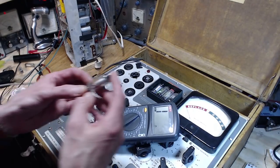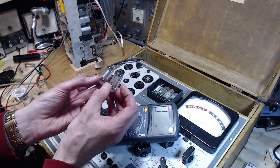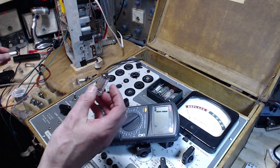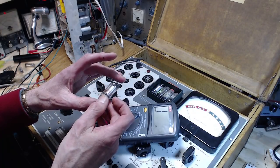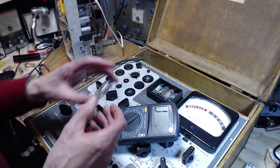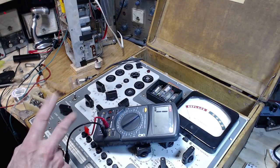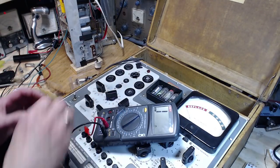Well, okay, picture's changed a bit, so I found another one. It has the correct shape. Except, you know what? It's not a 3V4. Unfortunately, there's another tube with the same look inside. 1S4. So it could be some of those tubes I thought were 3V4s. Or 1S4s, or who knows, it could be anything. So me testing them the way I did, you know what, I did proof the burned out element thing, so those were all 3V4s. 1S4, would it test the same way here?